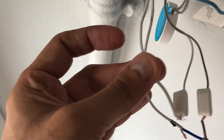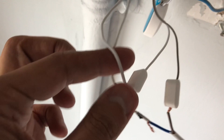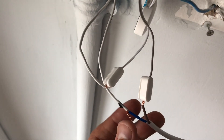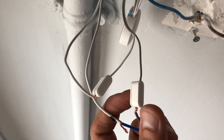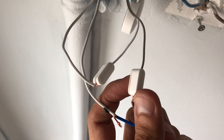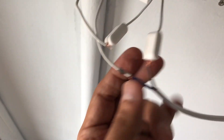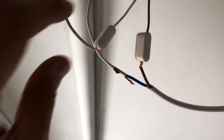These two wires are coming from my doorbell. One wire goes into the chime connector clip from the doorbell, and the other wire from the transformer also goes into the chime connector clip. The spare wire will be connected to the doorbell. If you didn't understand this, just leave a comment in the section below and I'll reply back to you.